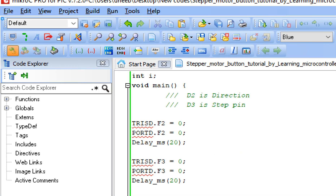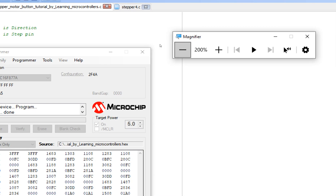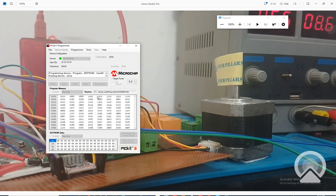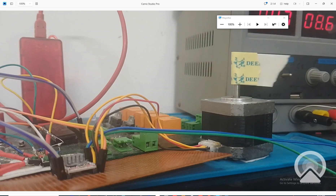Now let's build this code and burn it. The code is built. I click on PICkit programmer tool, import the file we just wrote, click Write. The code is being written. The hardware is stuttering because it's receiving random pulses during programming. Once done - it went four rounds and stopped. Total four rounds then stopped. The coding is working correctly: it goes four rounds and then stops.